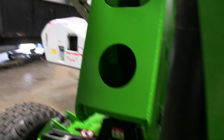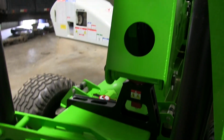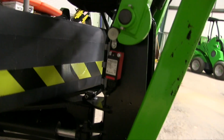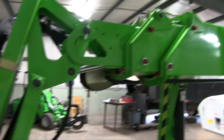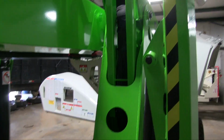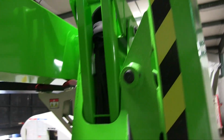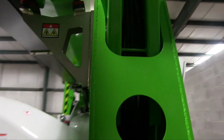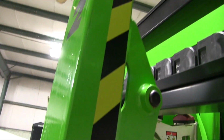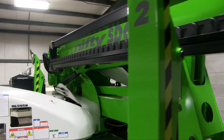Otherwise, if the boom is deployed and off of that mount, the jib has a sensor on it. If the logic board indicates that you're off the ground and the boom is not in this resting position, and the micro switch in here gets light, that lets the logic board know to sound the alarm to tell you that you're off the ground and one of the outriggers is getting light, so you need to come back down and check your setup.